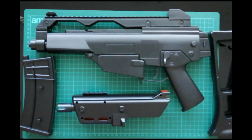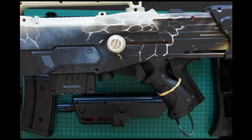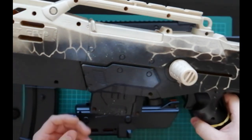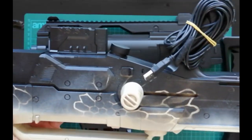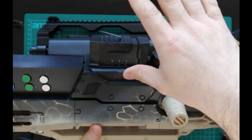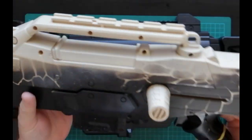This has been three years in the making, so we're finally excited to bring this to you. This is a custom controller — you can use whatever you want. We're choosing rifles at the moment, which is why we've got a rifle in front of us. For the prototype, if you haven't seen that video please check the description below. We chose this Nerf gun for its size. We had to modify it slightly — we have an analog stick at the front which required a 3D printed piece, and also buttons on the side. It needs to be wide enough for buttons to be opposite each other. We also have a reload button on the bottom and a look-down-sights button on the back.